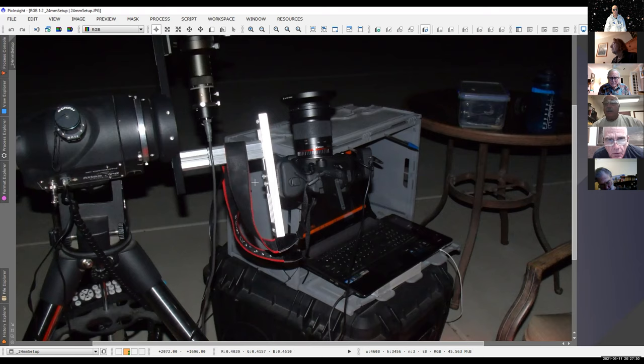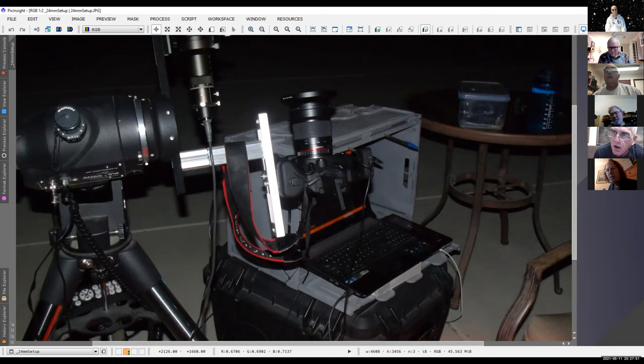That bottom screw right there is the one that screws into this bar. It doesn't go through; it goes through the bar and screws into the camera. This nut on top goes through a threaded portion of the bar and sticks out just enough to form a detent for the camera to hold it in place in that position so it won't swing side to side.